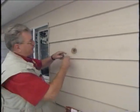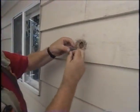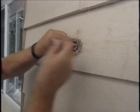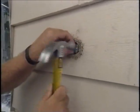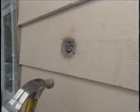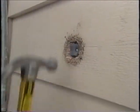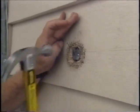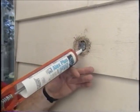What we're going to do to fix this hole where the woodpecker was — I'm going to put a bit of foam. I'm cutting off a piece of foam insulation, wrapping and tucking it into the hole, and nailing it into place. Once it's in place, that's acting as a filler, and then I'm going to caulk it with acrylic latex caulking.